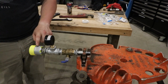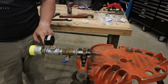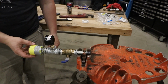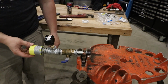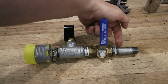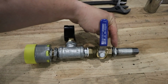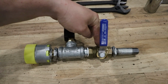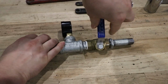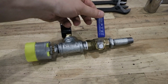This sprinkler head is a sacrificial sprinkler head, and it's actually part of the test assembly. But I'm not going to thread this in here until we build an adapter so that I can permanently install the correct head in the house when we get to that point. This is a 3-inch nipple, 1/2 inch black iron pipe. It goes to a 1/2 inch to 3/4 inch reducer bushing to a 3/4 inch 90-degree throw valve. It's very important that this be a 90-degree throw, quick open valve for the test to work properly.